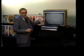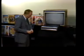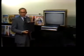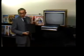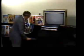Now, the random access model has the capability of finding any one of several thousand images recorded on our disc. It even generates a time display on the TV screen, plus additional graphics. And of course, it has to translate these groove undulations into a television signal, as well as into direct video and sometimes stereo audio signals.